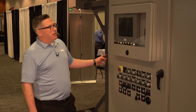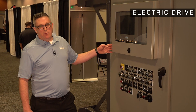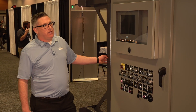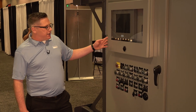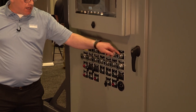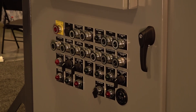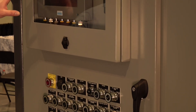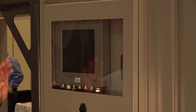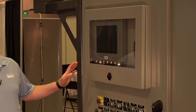This is the panel that comes with our UK373 plant. It's fully plug-and-play once you plug into a generator or the mains coming into the quarry. You can work everything from the switchgear here, which is easily accessed. The cone adjustments can all be done from in here for our CH440 with the Sandvik ASRI system, which comes standard with all our wheeled units.